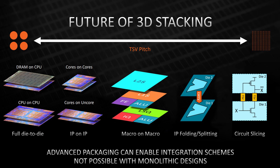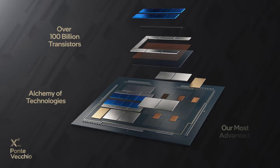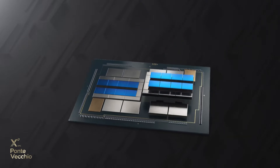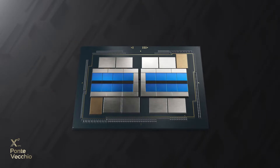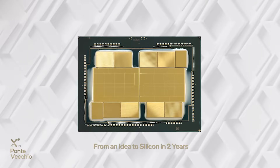Lastly, the big goal: circuit slicing. At this point we're stacking parts of the chip — different foundries make different parts, and instead of having all chips only stacked on top of each other, we have them on top of each other and side by side, making sideways connections from the same circuit, hence the name circuit slicing. You might think Intel is already doing that, especially after seeing their Ponte Vecchio GPU with so many chiplets close together, but Ponte Vecchio is still traditional chiplet design — they just crammed everything next to each other, with all connections underneath each chip.